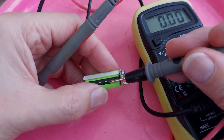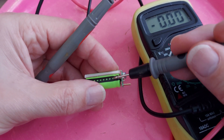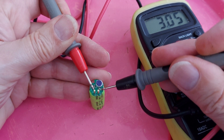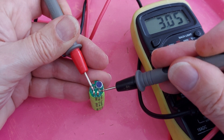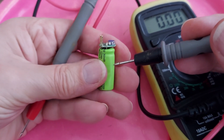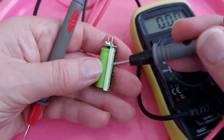That's got 'plus' written all up the side of it - I didn't even notice that. On your electrolytic capacitors, which look the same, the black bar indicates the negative and it has minuses all up the side of it. That would explain why I was getting negative voltage instead of positive voltage. We're down to three volts now - that definitely said about 3.4, 3.5 when we started. Because that one's been crushed, it's probably safest to dispose of it. I might de-solder it because I do want the sensor, and that little LED thing up the side is nice.